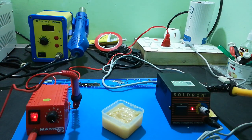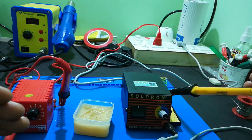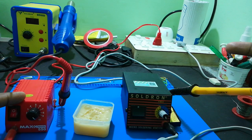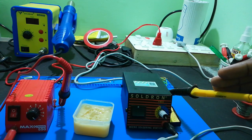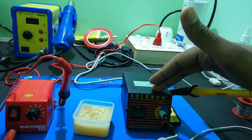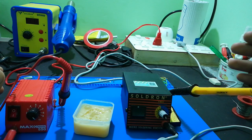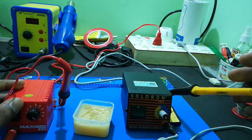Okay, so the two main differences are clear. First, the power cord: Salt Run has a 3-pin plug, Max Pump has a 2-pin plug - so safety-wise Salt Run is better, and it also has a fuse for added safety. Second, the outer body: Salt Run is metal with powder coating and an earthing point, making it shockproof, while Max Pump is plastic.